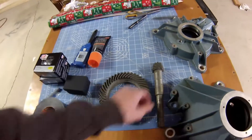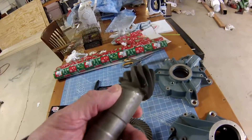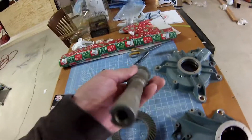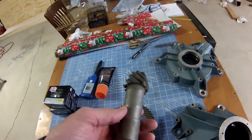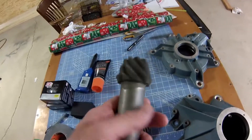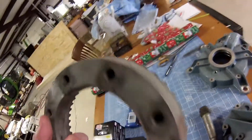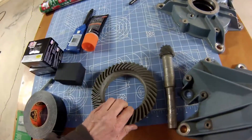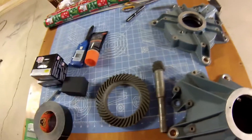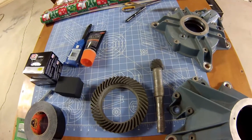Let's talk about ring and pinion gear heat treat process. They basically carburize the teeth to the correct hardness. As you can see, this thing has been painted — they paint this green stuff on there, kind of like what comes on a brand new end mill. They paint it off and carburize the gear teeth. You can see how they've just done the teeth and everything else is still nasty. This is exactly how they come back from heat treat — they kind of look like rust, but it's not. It's just that stuff burned on the shaft. Clean it up with Scotch-Brite.